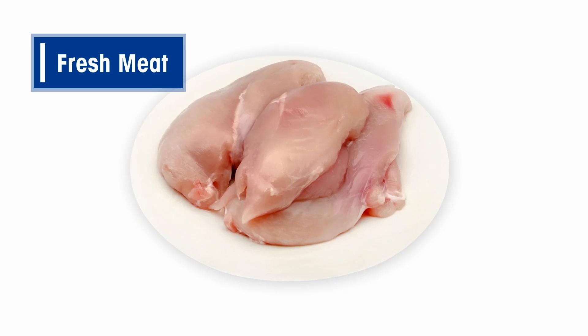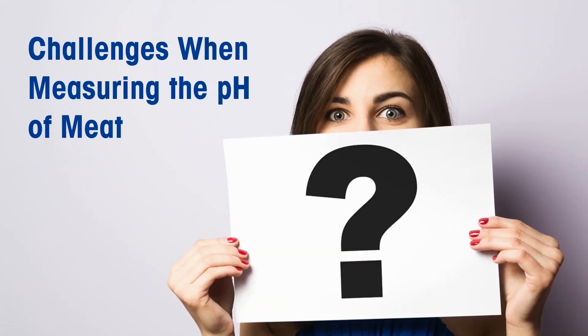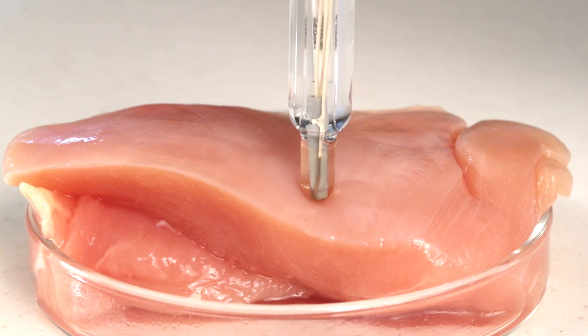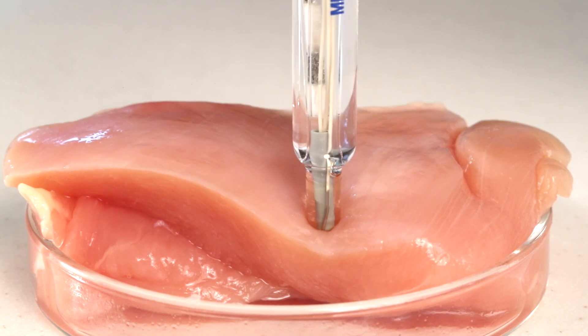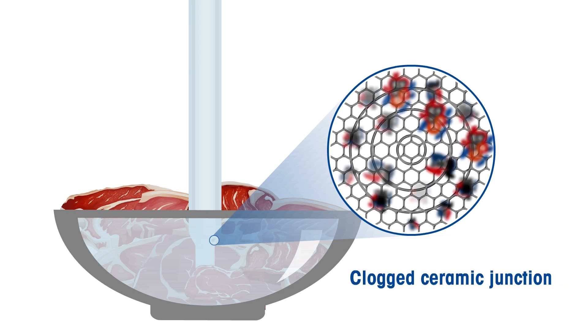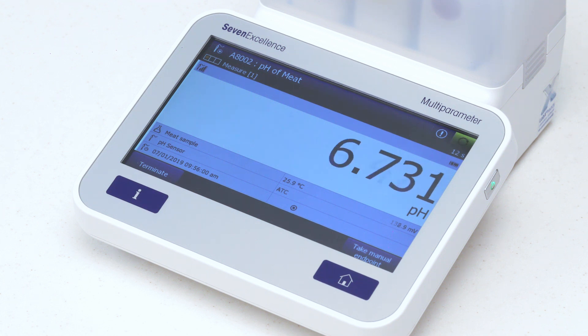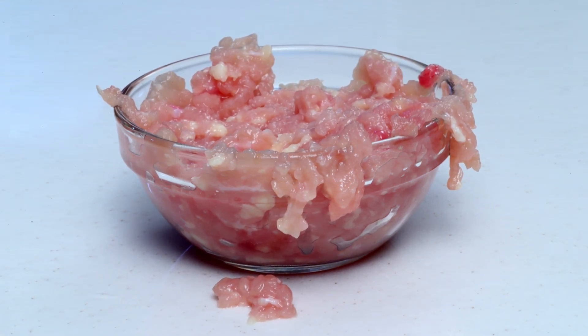Thus it is very important for industries to perform pH measurement of meat during various stages of manufacturing, such as processing, quality evaluation, and packaging. Fresh meat has a typical pH, and if the measured pH value is below a certain limit, it may indicate rancidity of the sample. Common challenges when measuring the pH of meat: it is difficult to pierce the solid meat sample with a spherical pH electrode. High fat and protein content from the meat sample can clog the ceramic junction, thereby preventing the electrolyte from mixing with the sample. High fat content can also lead to deposition on the glass membrane, resulting in fluctuating readings and high response time.